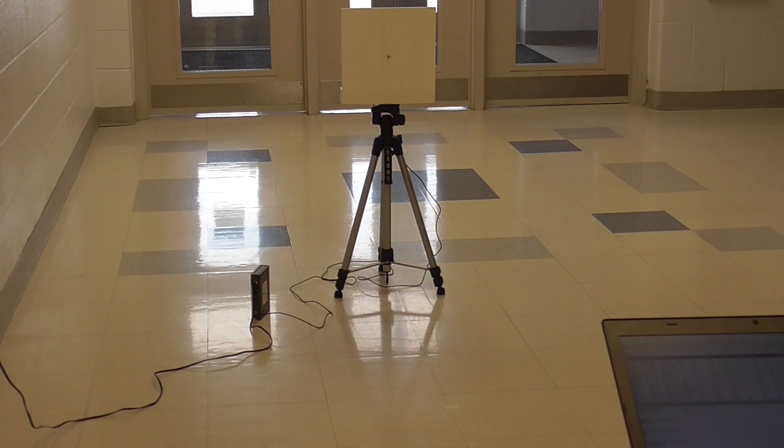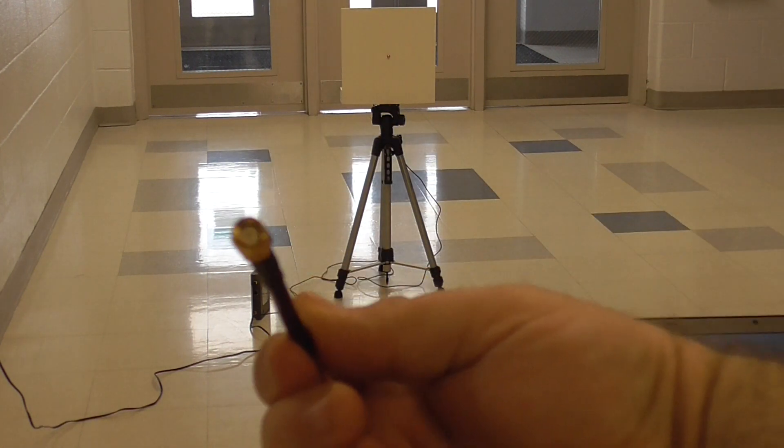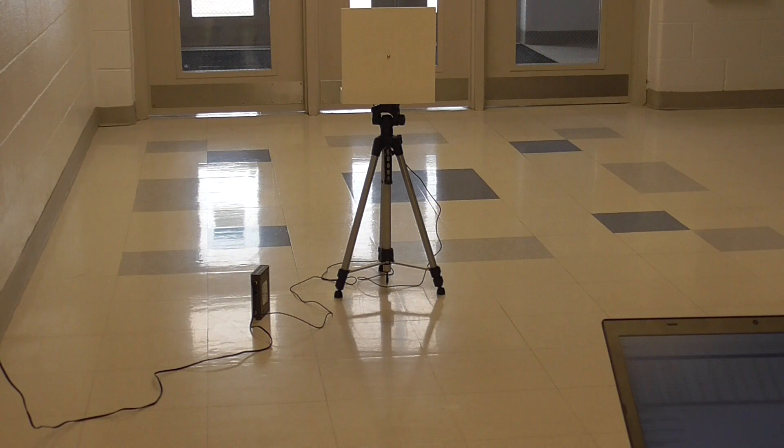Now I have my antenna. The antenna must have an SMA male connector, so it will connect to the female connector on the transmitting setup. The way it is determined whether connection was made at that distance is whether, when the antenna is set up, the RSSI value is stronger than or equal to the connection threshold.